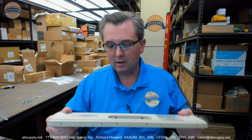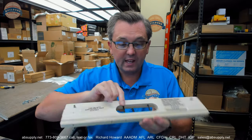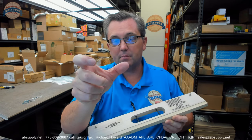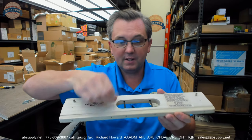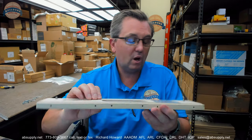You don't exceed that. The guide pins are, when they're in, you set your router inside of here, and all your routing is the body prep, that larger part of the hinge. When you remove your guide pins, now you are just mortising the faceplate. And that's all these guide pins do. It's just a fancy drywall screw is all it is. So now that we've distilled this down to its basic elements, it's like, okay, well, that's pretty easy. So you've got three of those.